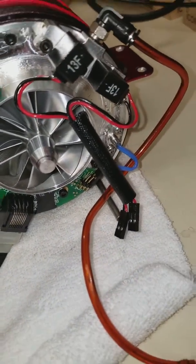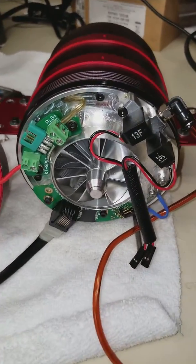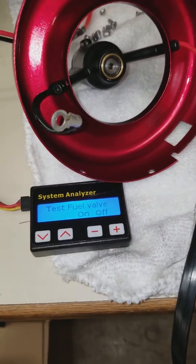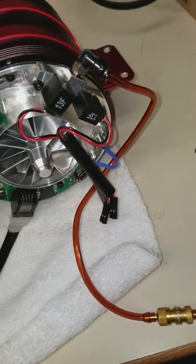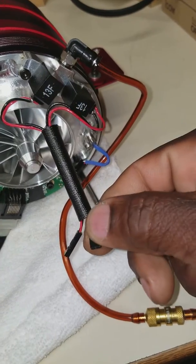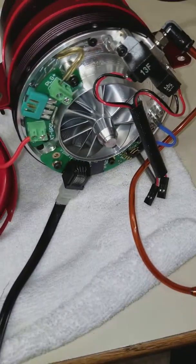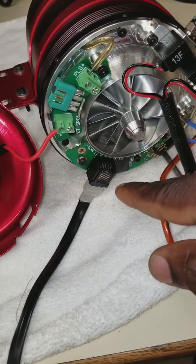This is a quick way to diagnose your problem and do a quick repair yourself. If you test these individually and each of them clicks and you can blow through the tube and feel the pressure going inside, then chances are the connector going from your engine to your ECU might be bad. You might call Barry and change it, or you can just buy that part from them.